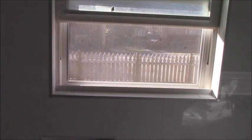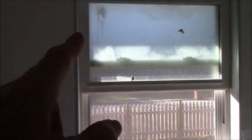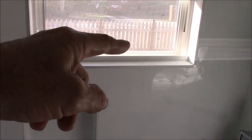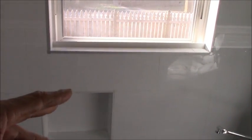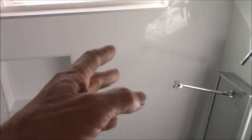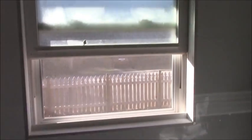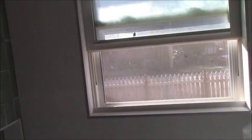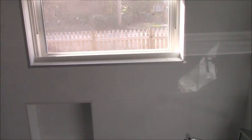She wanted a glass border running all the way up to the ceiling vertically, so there's no border on the tile itself. The window was already here and caused a lot of angst figuring out the configuration. The original wood trim was still there and caused a lot of issues — I had to rework the wood inside the shower, which took up a whole day. Trimming it out with the Schluter strips and corner pieces worked out pretty well. I had a vision of how to make it work, and in this case it did. The same Schluter strips got applied on both the left and right sides.